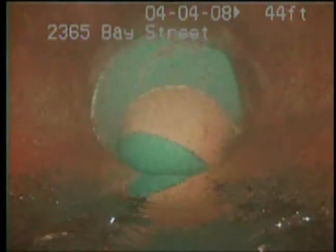I'd recommend installing a cleanout if you do replace that orangeberg, right about in this area, so that if you have future problems you can address them out there. There's a little crack in the clay right there in the bottom right.